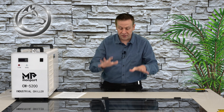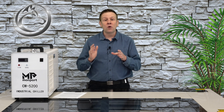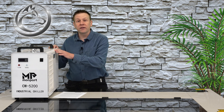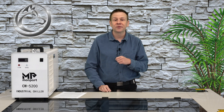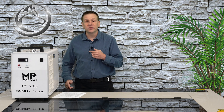The first thing I'm going to do is connect the water lines between the laser machine and the water chiller. To keep things very straightforward and simple, I'm always going to go from the output of the laser machine to the input of the chiller, and from the output of the chiller to the input of the laser machine — always from an output to an input. To help clarify, we're going to take a look at the back of the chiller unit and the laser machine.